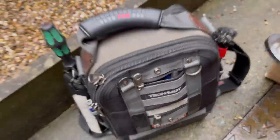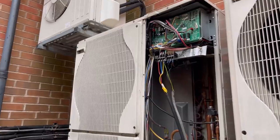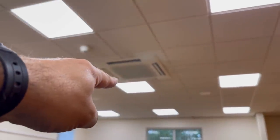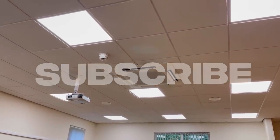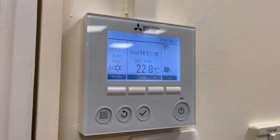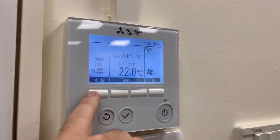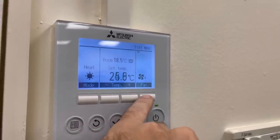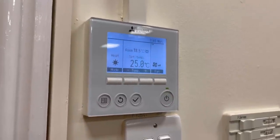Just grabbed the Tech MCT. I think I might actually get to use the world's most expensive umbrella. That is running now. We've got a Mitsubishi Electric — just a split system, a ceiling cassette. We've had some reports of an error code, so I've just switched this on. We can have a look at the error history — I think it's a U8 fault that's been reported.